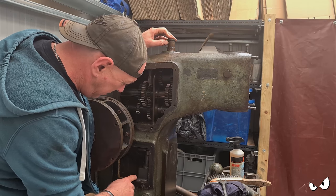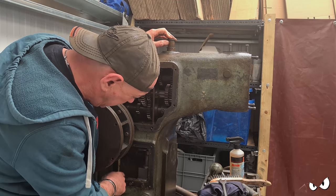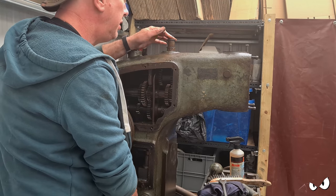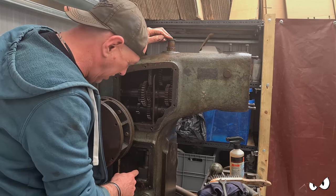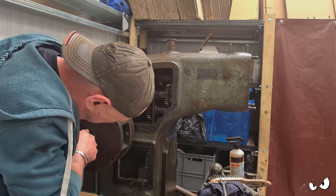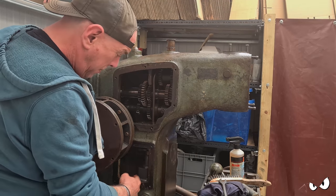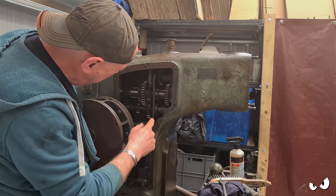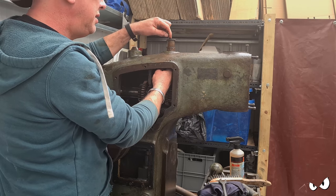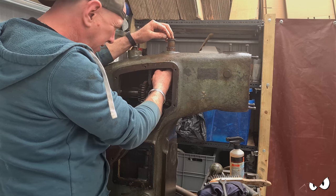So down here, we've got what looks like an oil pump to me. This hole down here would be the oil reservoir. I don't even know how you fill it, but that will all be full of oil. There's gears in here, which if you spin this, you can see it's driven. That would feed power to the oil pump. Oil would get pumped up this line here. It goes up the top, and it would basically squirt into the sight glass, so you can see the oil's in it and it's being pumped.